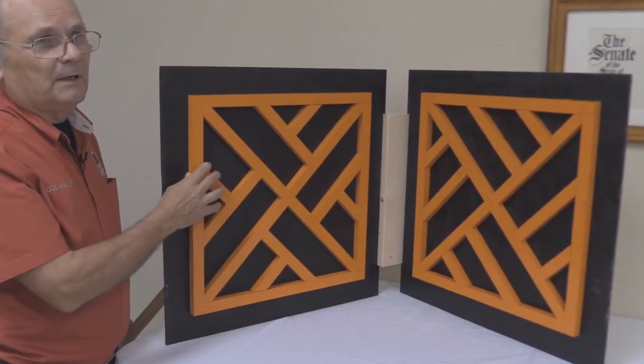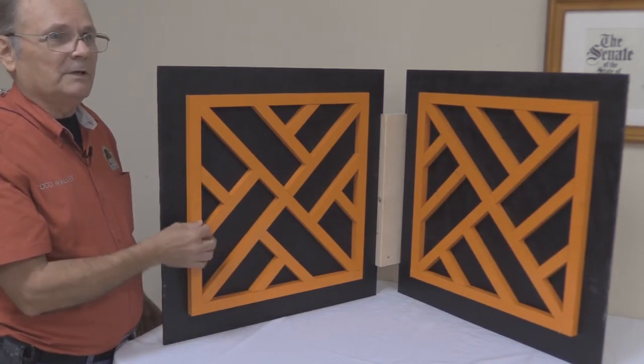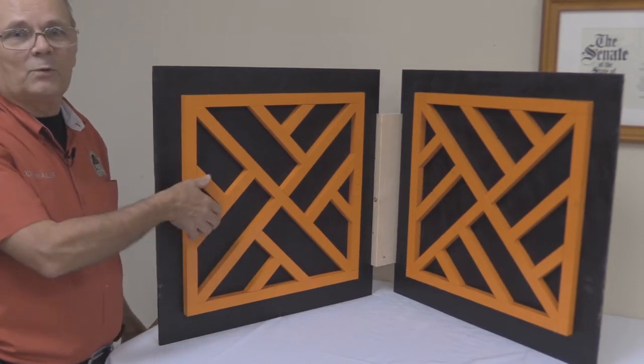On these pieces here, I didn't use tenons on everything because this was going on a back. The only tenons are structurally holding this together. I used a nailer — a little air and some nails — because that's all that was needed. Normally if I'm doing these, I'll cut this side long so that if I need to adjust it to make it fit flush — it might only be a sixteenth — where the gap between the two doesn't show up. I can move the piece and actually fit to the tenon that way, rather than have a little gap between them, because that gap will show up a lot more than the fact that it might be a couple of degrees off square.